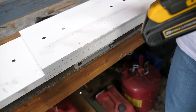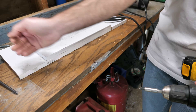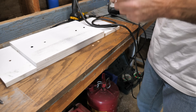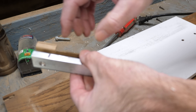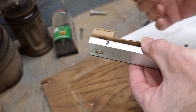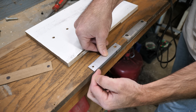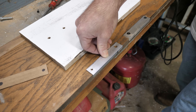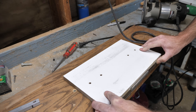This isn't going as smoothly as I had hoped. Just one cut left per part and we'll be done. I hope they fit. I'm not going to tell you what these are for, but I will leave a clue in the video and you're welcome to guess in the comments. The time has come to make our last cut on these brackets. I need to remove this bit of metal so that all that remains is the little overhang. I'll orient the bracket this way — I've already got the other one screwed on — and cut from the side. I want to do it from this direction so that I have a nice little radius at the end of the cut, which I think will look nice. I've routed out the bottom of the shelf so this can fit over the part as a guide.